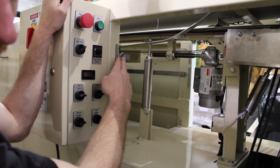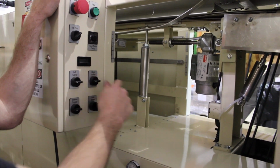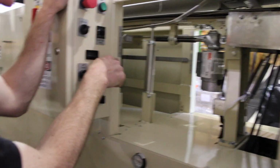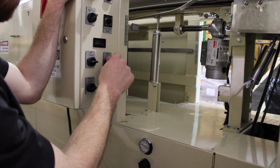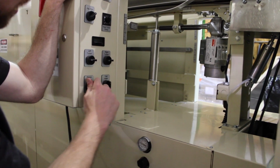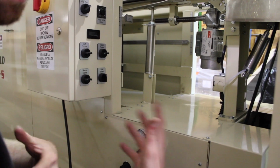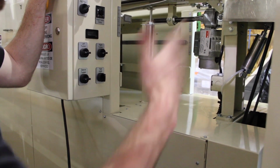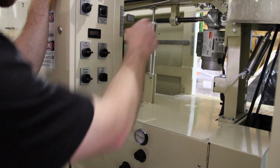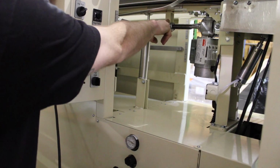Now your sleeve tuckers are what actually fold the shirt. So your left tucker, we're going to set at 2. Right tucker, we're going to set at 2. You're going to see 1 through 4 on each side right here. Left tucker, and you've got 2 more over there. Right tucker at 2. Sleeve tucker at 2. That's your default. So 9 by 11 is pretty industry standard for almost anything adult, small through 2XL. But full width, your sleeve tuckers, 2, 2, 2, and then your fold width at 9.